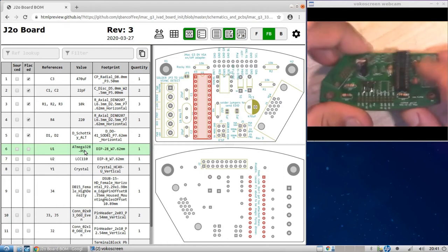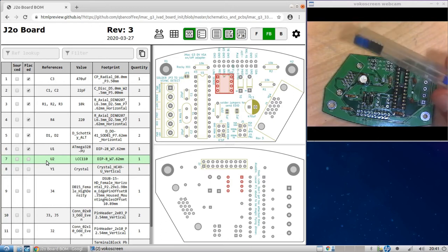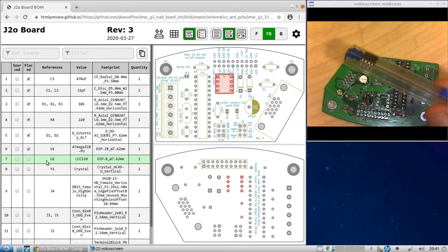All right, so the socket is in place and it looks good. Let's check that off. All right, let's go to U2, the solid state relay. This is a relay with no moving parts. So that actually comes in here. Touch ground or something before messing with these ICs. Try to ground them yourself, because static discharge can destroy these things. I have broken some of these.